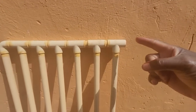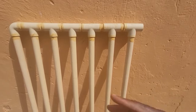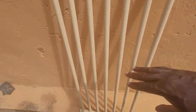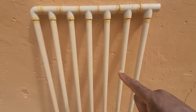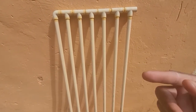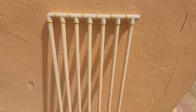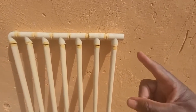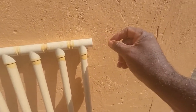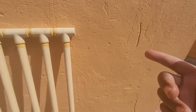The water would trickle out of this here, and when I say trickle, I do mean trickle — you do not want a very large flow coming out of here. You're going to have it pressurized coming in here, and the pressurized water is going to fill all of this. You want to give the water in here a little bit of time to, shall we say, lose that 'ouch' about it. So it is going to rise a few degrees and then slowly trickle via the controlled tap into your storage container.